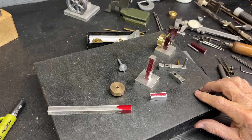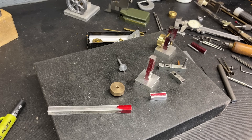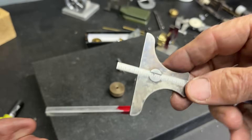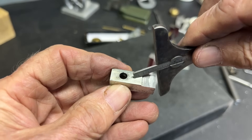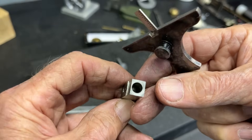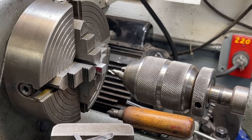The four-jaw chuck is already in the correct position because I only backed out two jaws — that's a little trick for you. Start buying yourself tools and machinery; forget about those Nike tennis shoes, they do not matter. One thing to note before going to the lathe: the depth is five-eighths, checked with a little starrett depth gauge. The reason for that depth is we do not want the hole to come all the way up to the three-sixteenths hole, but we do want it to go a little bit past the one-sixteenth inch hole, because that is the air inlet or steam inlet to the cylinder.